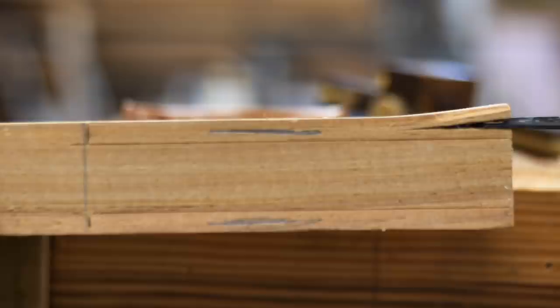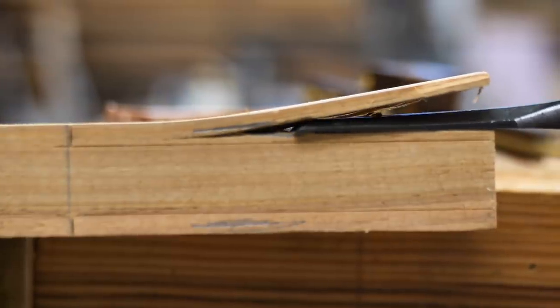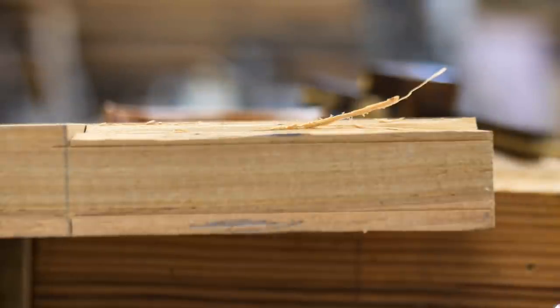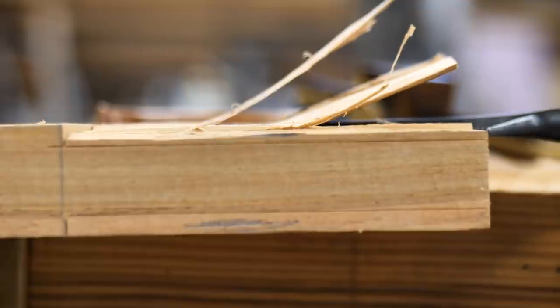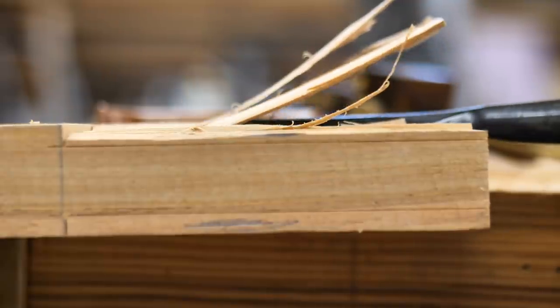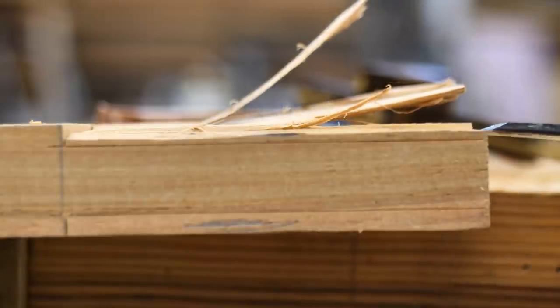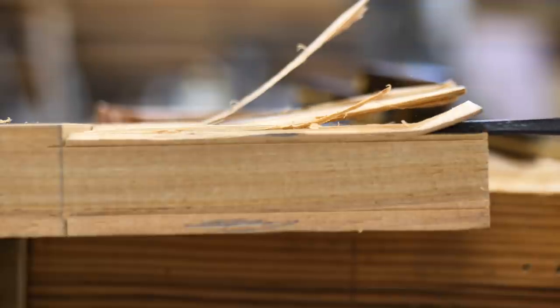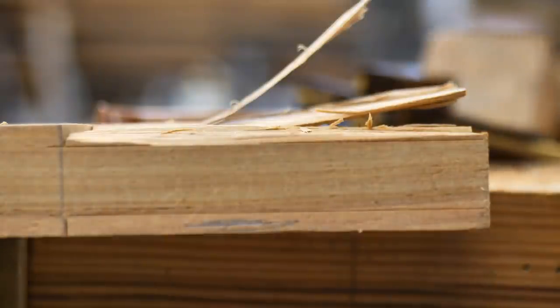This is a really cool shot and you can see this technique only works if the grain cooperates — and you're going to see it not cooperate on the next one. Basically I've hand sawed the shoulder of this tenon and then I just come in with a chisel. I was taught this technique by Paul Sellers in a class I took with him. Chisel it down as close as you can get to that layout line and then we'll come back and clean it up with a block plane. You see how I stopped there because I'm watching that split and it was starting to head down into my layout line.